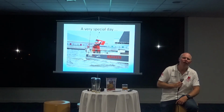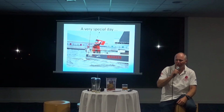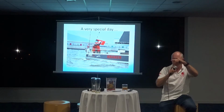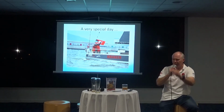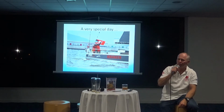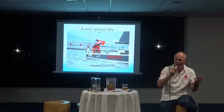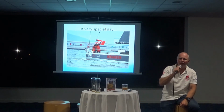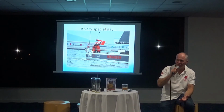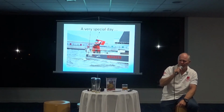Could you elaborate on the personal AIS? Yes, they're common now. The size of a pen, about that big, that round. In essence, you get a VHF signal to your chart plotter from them. So it's for most boats, because you'll be picked up by another boat, is the quickest way to get rescued. It's the best device to have. So we still carry PLBs, which are 406 megahertz GPS transmitters, which you're required to under your racing rules, but the AIS sticks is really the better device.